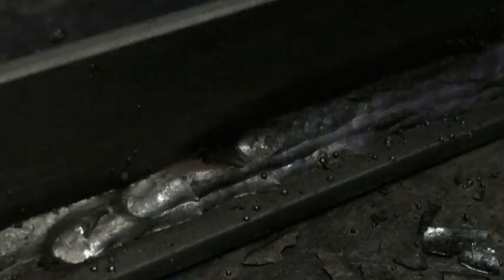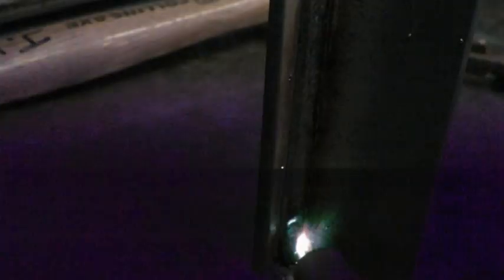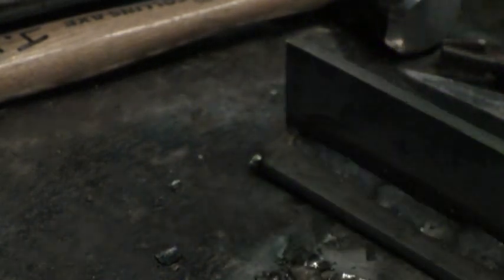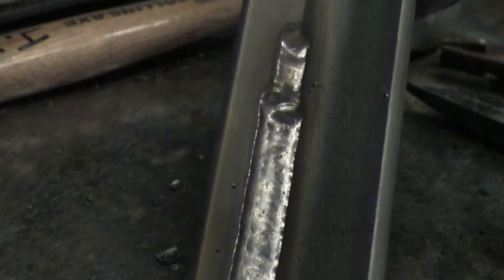The spatter that's on there should come off. As I chip the slag off, we should have a nice, relatively flat weld bead. The finished product of flux core should be reasonably flat. Get a flashlight out and take a look. Pay close attention to the ends of the welds — they're shaped like the puddle. Notice where the center is — that's where the wire was. Here's the overhead, now down on the deck. Not perfect, but you try welding with a camera in front of you and see how it comes out.